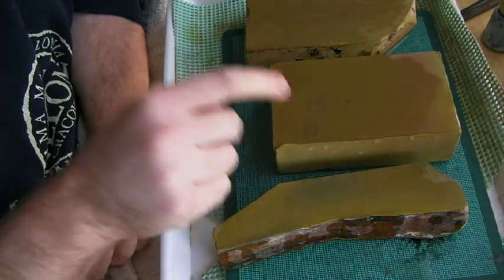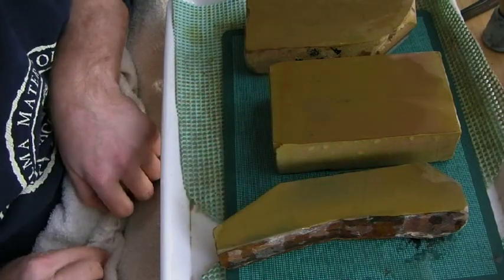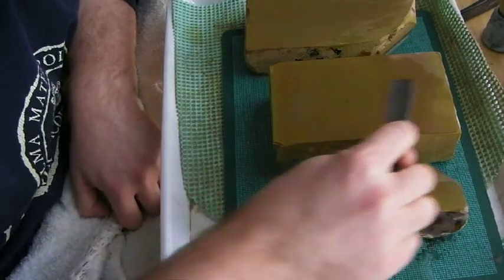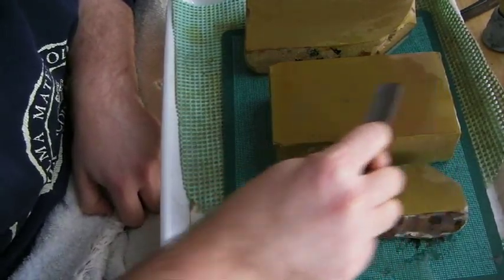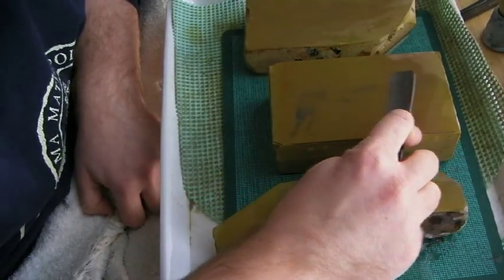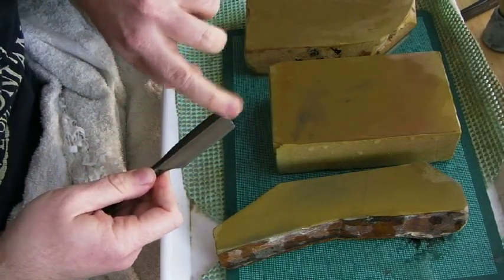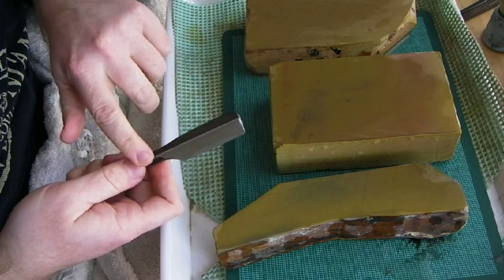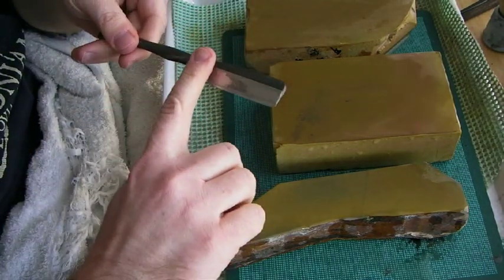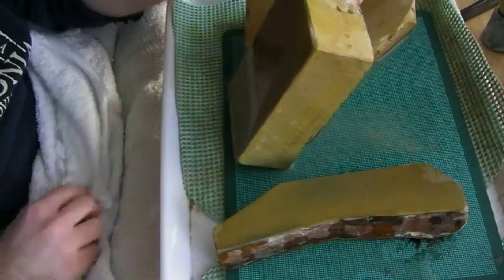Can you see that black? Nice abrasive power — very, very handy in this stone. There's some yellow in there, but there's a lot of black. What that tells you is that it's actually wearing away at the steel. If this was a very heavy slurry, we couldn't trust it so much, because that slurry could be building up around the back part and wearing off the black before you get off steel. But as this is not releasing so much slurry, we can be confident that the steel is coming off with this blackening. That's a very good sign of abrasive power.